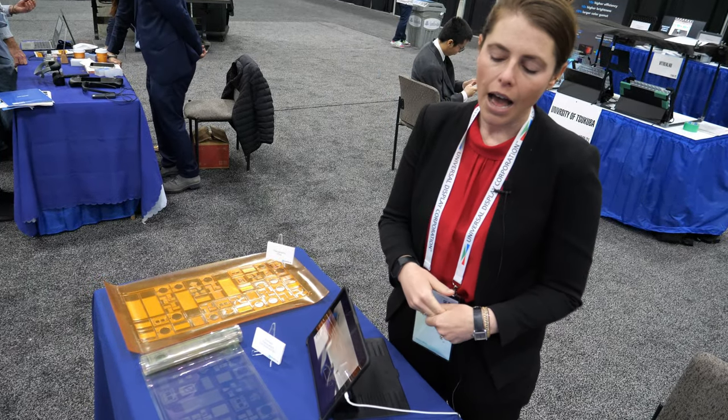If a partner comes and helps you go as fast as possible, how fast could it be before mass production? Right now we can do demos, we can do custom demos, we can print full OLEDs on our tools. We expect to be in mass production sometime next year. And full active matrix? A few years down the road. Right now one of the limitations is we can print down to about 100 microns comfortably. Flexography can generally go down to about 25 microns. There have been some innovations in plate materials specifically from Kodak that are able to print much finer. Between resolution and registration, those are the two things we need to improve upon in order to get to active matrix.